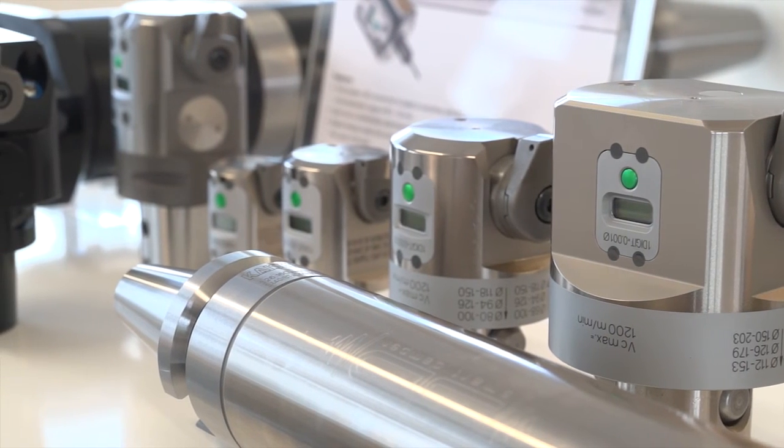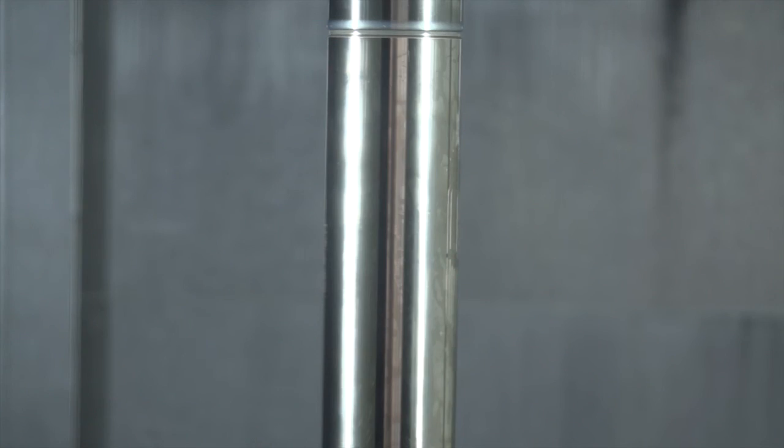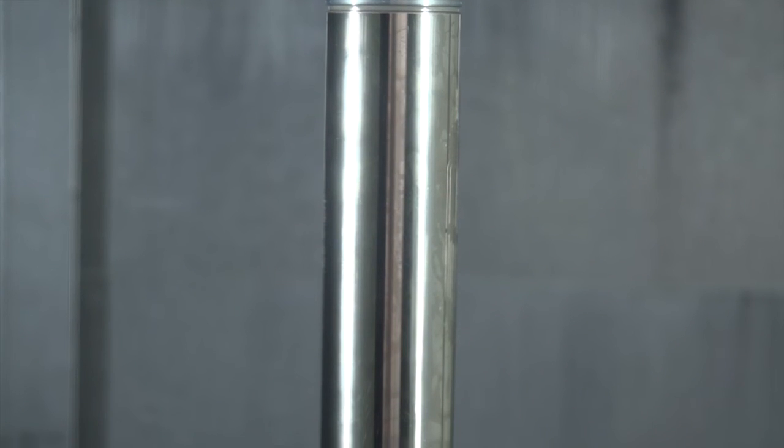John Paolo, the EWD boring solution with smart damper technology — what makes it different to all the other boring solutions? We took the high precision boring system from Big Kaiser and we combined it with our patented damping technology to enhance the precision and the performance on the boring system, especially on the deep hole boring types, in any kind of materials.